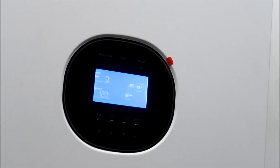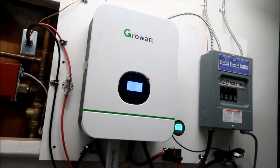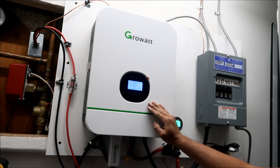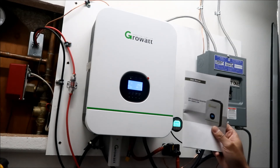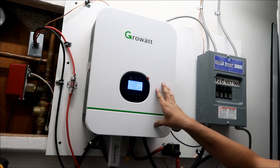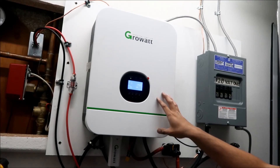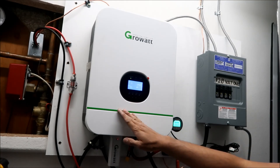That is Hades Omega's initial setup for the Growatt 24-volt inverter. For 48 volt I imagine you'd want to put in 48 volt settings. I'll link the website where I got these settings in the description. There are a bunch of other settings not in the book and not on the website - I didn't touch those. In the next episode we're going to fire everything up and see how it works - we'll check if we can charge the battery with PV power and power some loads.